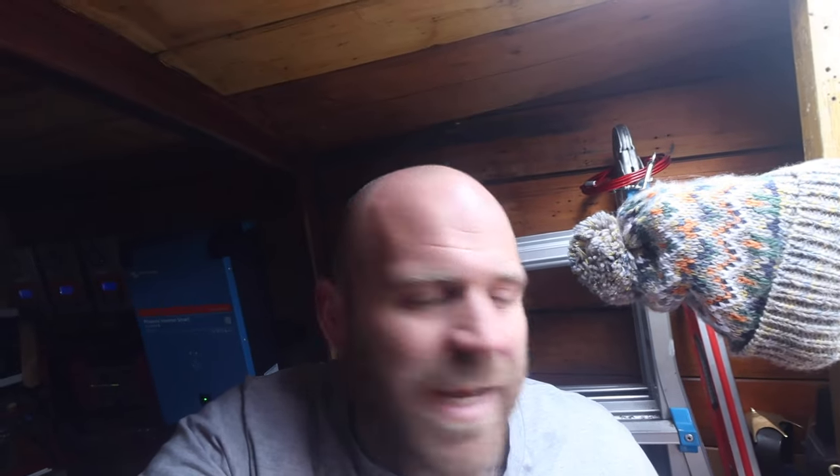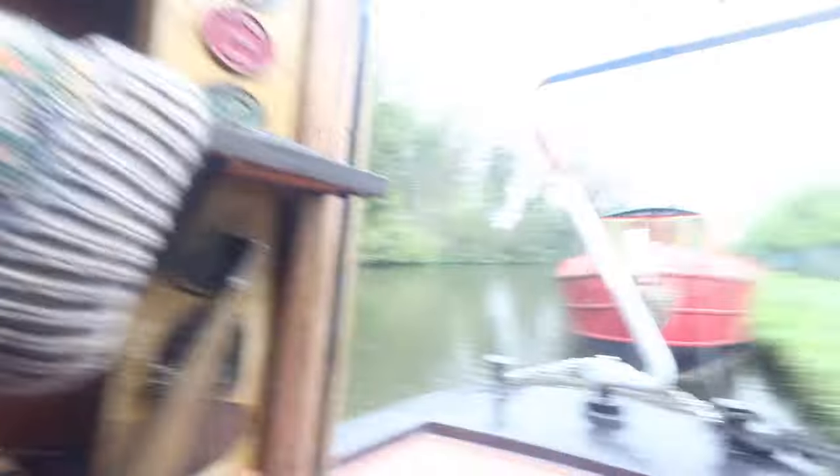I would say we'll move it to test it now, but it's just started bloody raining. Well, that's that sorted then, folks — we've moved since as well and there's been no more dribbles. That extra bit of torque did the trick. If I had torqued it up to 120 foot-pounds right from the start, maybe we wouldn't have had this problem — but there's still a chance it could have leaked anyway. And if I'd already torqued it up to 120 foot-pounds, there'd be nowhere else to go. So I'm still glad I didn't do it up to the full torque as recommended. Now we are safe in the knowledge we have got no oil leaks. Happy days.